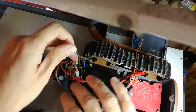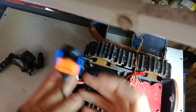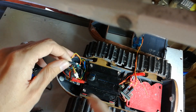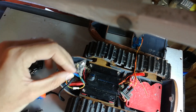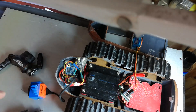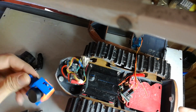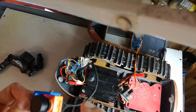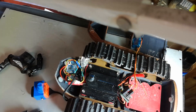In the back here I've got the FPV gear. This one has the Runcam Split version 2, so it can record HD which is nice. There's a little 200 milliwatt transmitter here, but if you're going small and simple and don't actually need to record video, you could also use an integrated transmitter-camera and probably save yourself a lot of hassle.